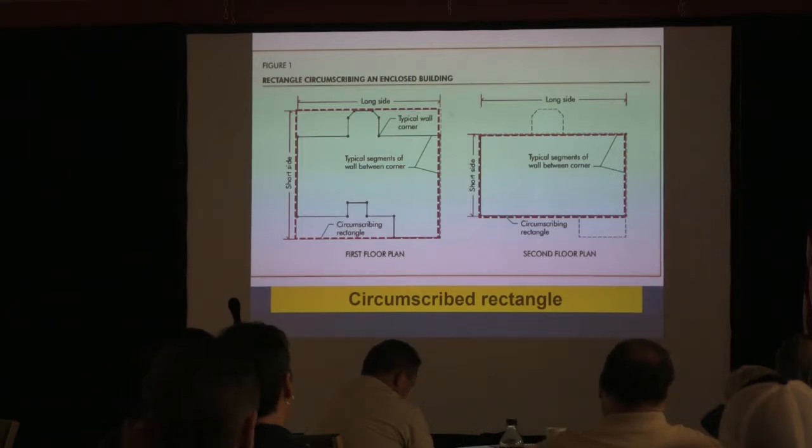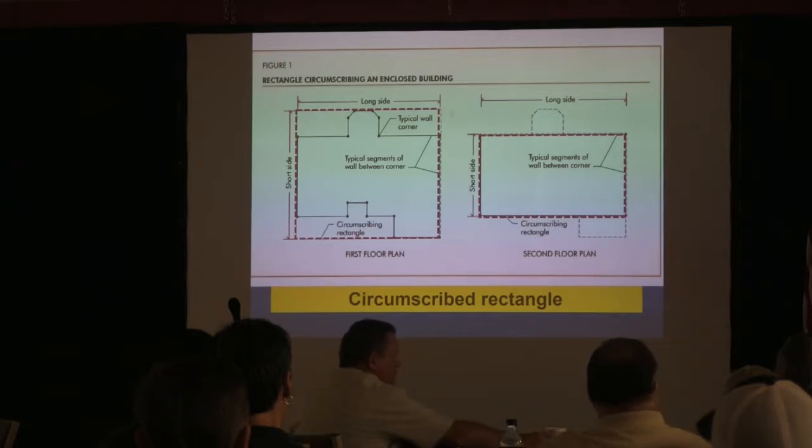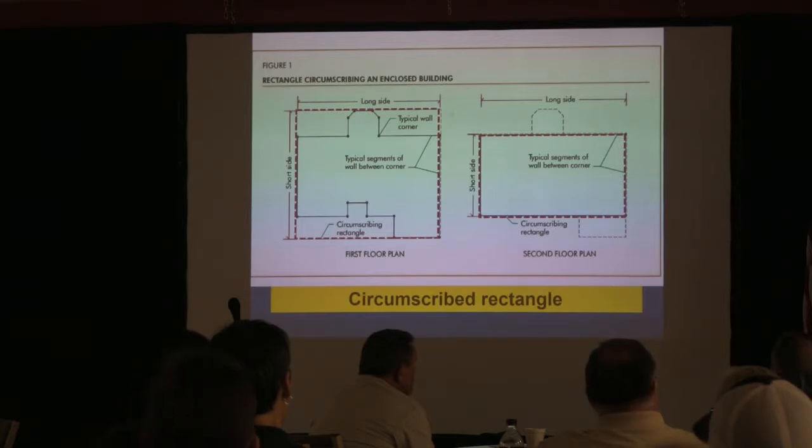A lot of those homes, and even non-stucco homes, have sheathing on the corners, but insulator board or fiber board on the field studs. Absolutely. That's a great point. I forget that because I'm so used to just seeing all that, but somebody can say they're doing it also for the value of the insulation by putting that insulator board. I've worked for Bill doing stucco and mold inspections before, and especially on the south side, we'll go into an attic and look down the wall and catch insulator board, not OSB. Yeah, that's the same thing with eaves, they use gypsum board as a sheet. Right, yeah. So, am I wrong, Mike?